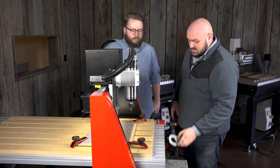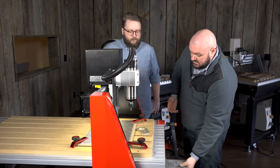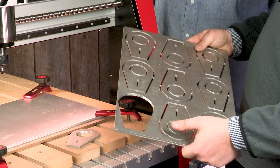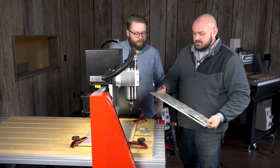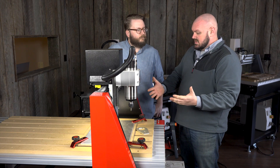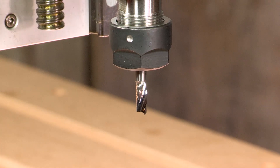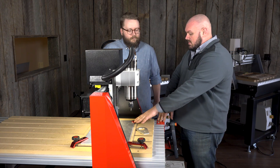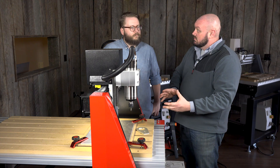This material is being used to machine a bracket, which is something we're using in-house for a project. When we cut those, we may need one, two, or twenty. The beauty of the Vectric software and working with sheet material is that we can tab the parts, cut them out, and nest them in large quantities. This design is created just like we did our signs and any other wood part, but because we're using an aluminum-specific bit, we have to treat it differently. With wood we might take it in one pass or a few shallow passes, but with harder material we're actually going to take this in ten thousandths of an inch per pass at a slightly slower feed rate and a dialed down RPM to prevent any melting.